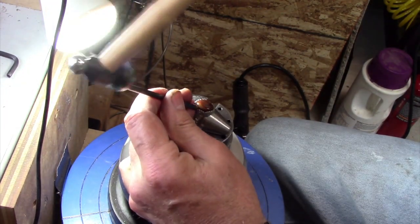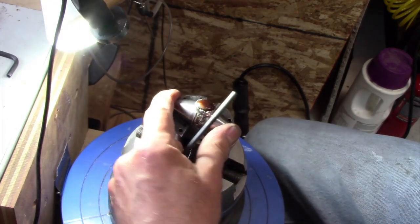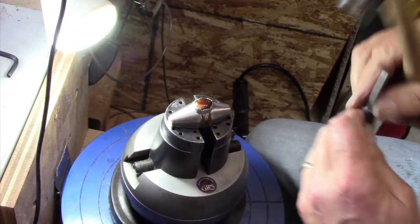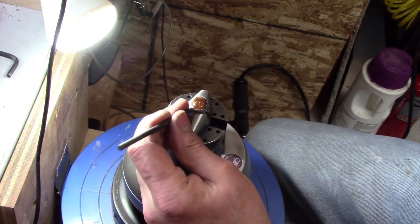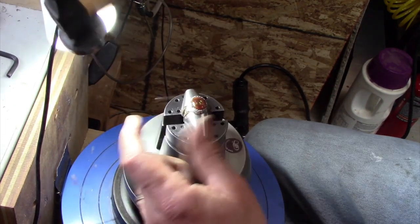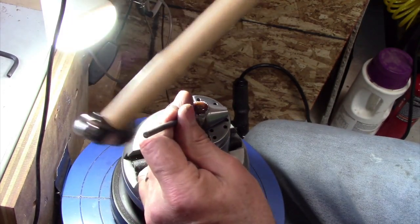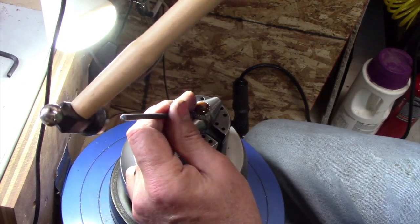So I would have used a burr to carve a seat a little closer to thin down the metal from the inside. In other words, cut some of the metal out of there on the inside. I think if you cut like a third of the bulk out of it, you could then use a pusher or a relatively simple, less aggressive means of setting this.